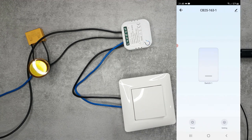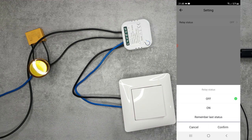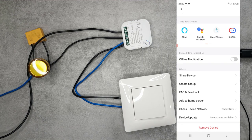Finally, the device settings. There is a settings button where you can set the relay status - what I'd call the power-on status - specifying whether the light should turn off, turn on, or remember the last status after a power loss. Many devices default power-on state to 'on', which is annoying because a short power outage at night turns your lights on. You can also rename the device, change the location, and share it with other users.